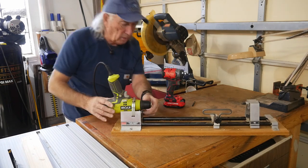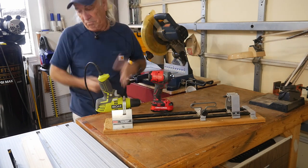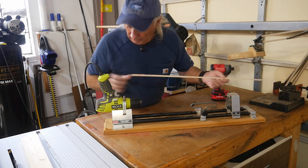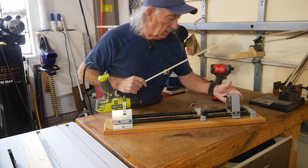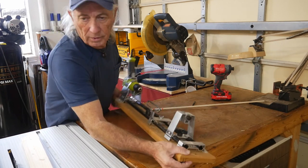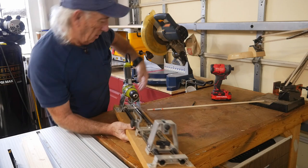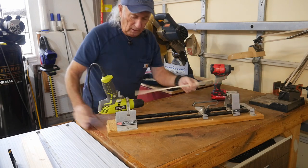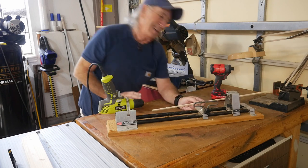It's sitting on the screw nicely. To get a reading, I'm using a piece of doweling — I just want to show you guys what we're up against. The alignment this way is because this is a V-block on this end, and this end is adjustable height up and down. You can loosen this slot, drop it down, or raise it up. I messed up the other day and raised it a little bit. I took a piece of doweling into the drill to try to get a pretty straight shot between this point and this point, because ideally you don't want the machine fighting itself.